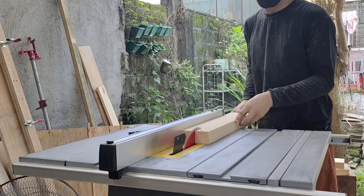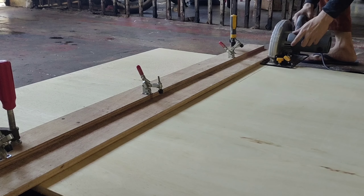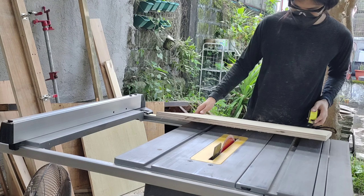For the top of the platform, I'm going to use plywood — marine plywood. I chose marine over regular plywood since my shop is a bit outdoors and it can be humid, it can rain. So just to avoid any troubles with moisture, I use marine plywood, since it's more durable against water and moisture than regular plywood and plyboard.